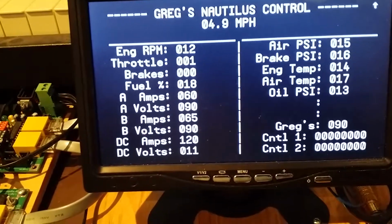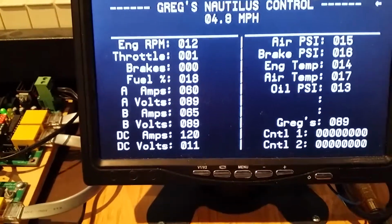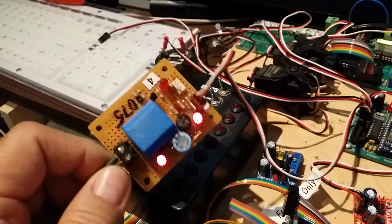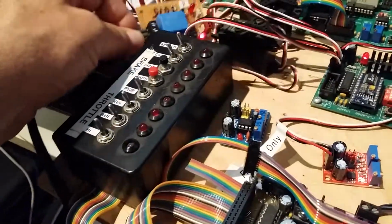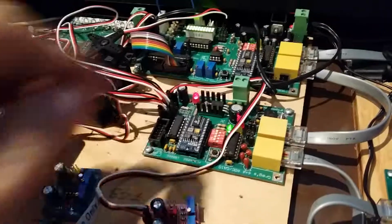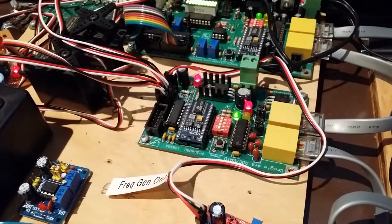And again, it tracks pretty well. I'd just like to smooth out the ripple in the voltage some more. And since I have to build a PC board for this, maybe I can come up with some sort of more sophisticated rectifier filter system that'll take even more of the ripple out of the AC when I turn it into a DC voltage to read with my converter.